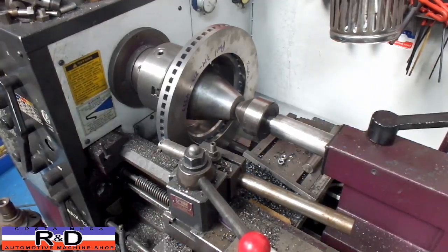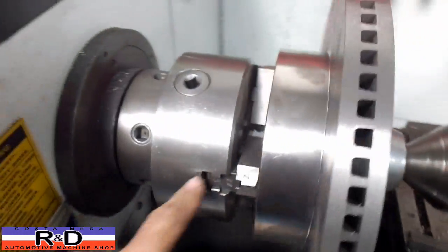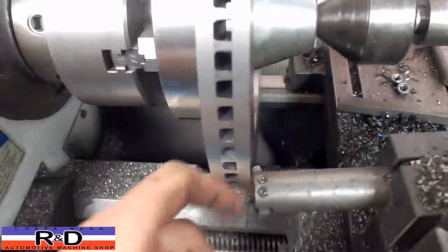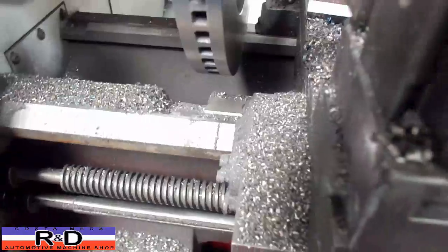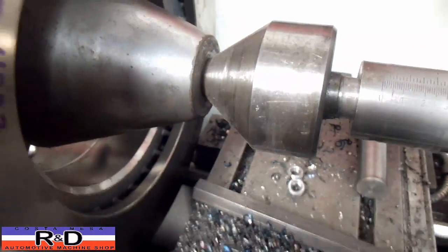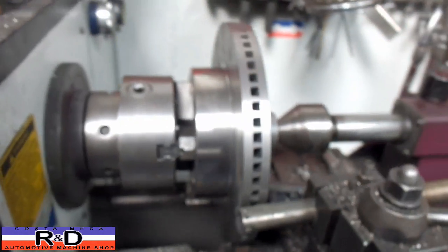All right, well that's it. To recap: we used a cone to help support the workpiece on the inside, held in with the center. We used the outside jaws to actually clamp on this, and we used a fairly straightforward tool bit. We used a boring bar, and that worked out pretty well. We had to be mindful of the diameter down here so that we didn't crash into our carriage — it does hit there in the back. This isn't really rocket science; this is pretty simple machine work. If you have questions about this, give me a call here at Costa Mesa R&D. We'll see you soon.